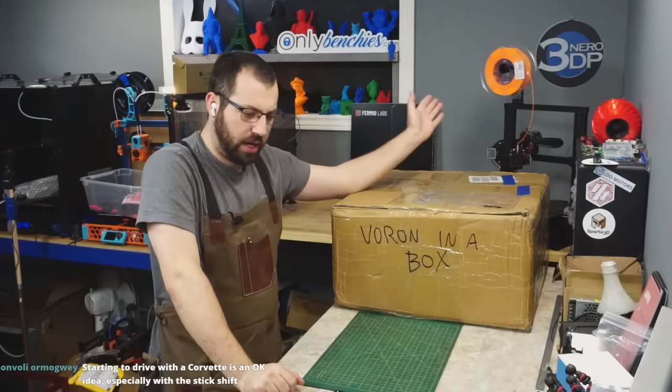Let's take a look at this plate. Okay, so this is fully machined. Now, is this de-stressed cast aluminum? That's the question. So normally with the cast aluminum tooling plates, they're cast, they're shaped to size, they're de-stressed through a heating process, and then they're blanchard ground, okay? Regardless, we're just gonna call them cast because that's easy. That's the terminology people use, okay?